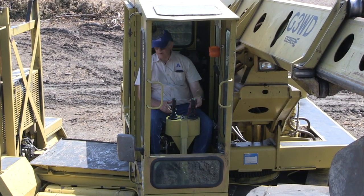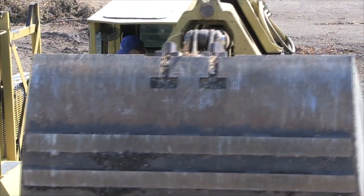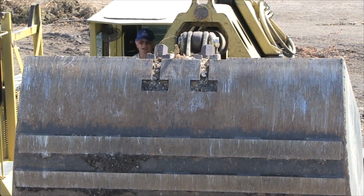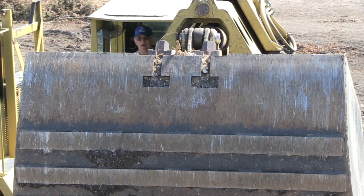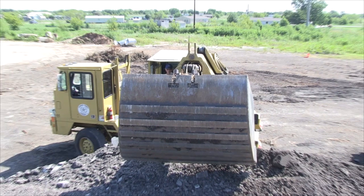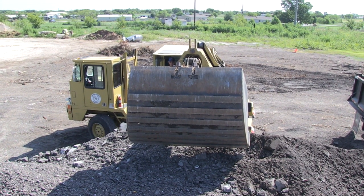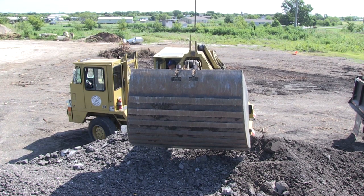It's better to swing around, and you can do that off either side, because it'll allow you to get to the steps and you can actually get off and on the machine from there using your three points of contact, without crawling up and down off the tires, which is not a good thing to do, and without having to cradle it also. So, all right.